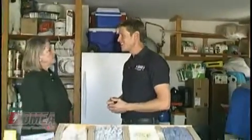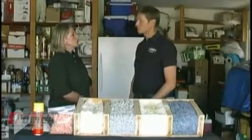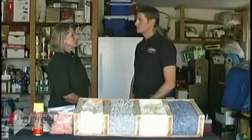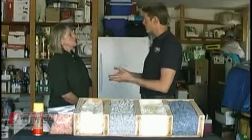Let's get our energy audit started. We're actually in a member's garage today, and Nikki Smalls from DMEA is joining me. What is the first thing a homeowner needs to look for as they start their energy audit? One of the most important things you can do is go up into the attic and make sure that all of your holes and gaps are sealed. The second thing is to address insulation levels. You want to be up there looking for plumbing penetrations or electrical penetrations, things like that.